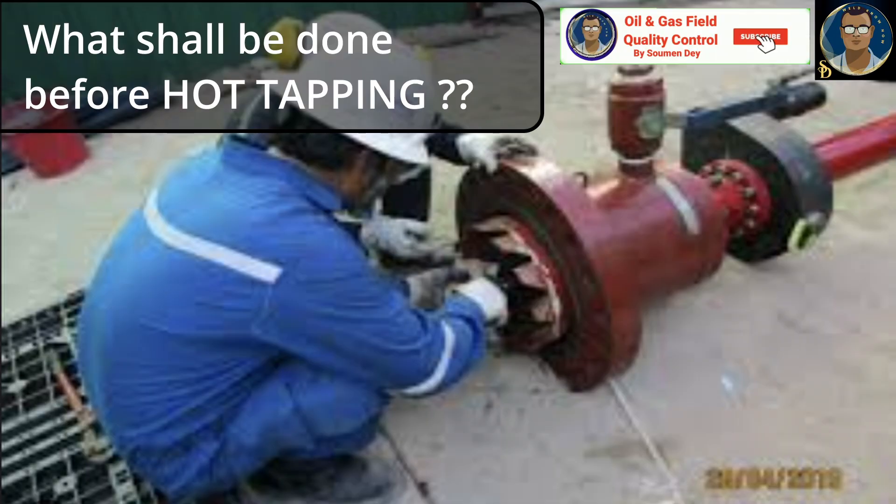Based on my own experience, before performing hot tapping we must check the hot tapping location for roundness defects or any lamination and record them. Check the actual pipe wall thickness, as hot tapping has specific wall thickness range requirements to consider. Also check the actual operating pressure and temperature at the time of the hot tap, which helps confirm the integrity of the main pipe during cutting.